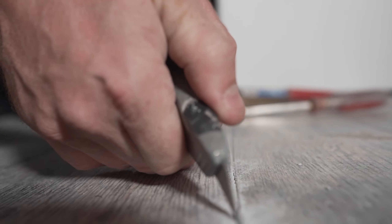After washing the tile, there will be a little bit of haze. Don't touch it right away — let it dry. Maybe the next day or a few hours later, you can come back and just wipe it off. It'll come right off because it's just haze and won't really stick to the tile, unless you have an excess amount. If you have any suggestions for what you want us to show you, any questions about tile, stone, or anything like that, write below and we'll get something going for you. Thanks for watching ACVBuild — see you on the next one!